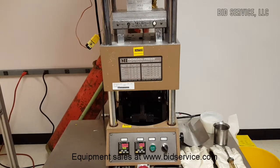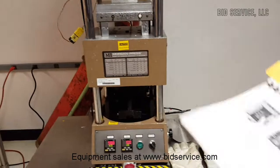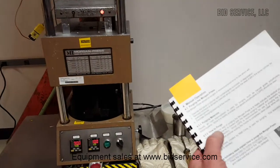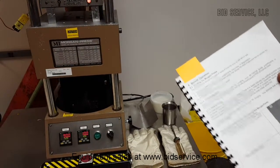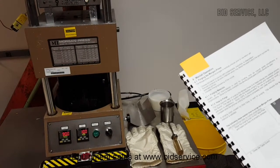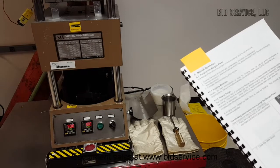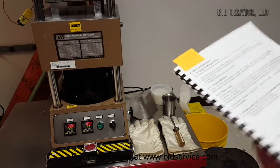To demonstrate the injection molding capabilities of the press, solely for the demonstration, we're going to follow the procedure for how to purge the system. Normally, that would be to clean out any residue polymers that you might have before you want to put some new virgin material in there.